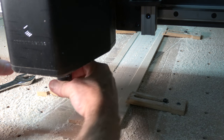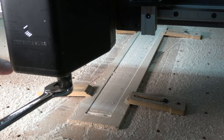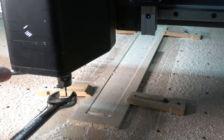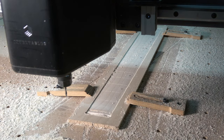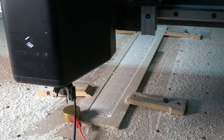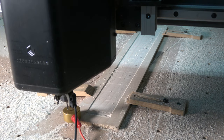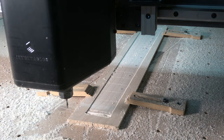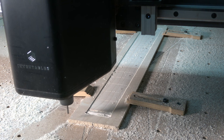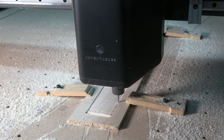The final CNC cutting operation is to cut the perimeter shape of the fretboard, using an 1/8-inch diameter two-flute spiral up-cut bit. My settings are 136 inches per minute feed rate, 40 inches per minute plunge rate, 0.125 inches depth of cut, 18,000 RPM spindle speed, and once again I'm using that 20-degree ramp.